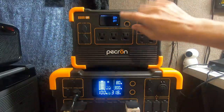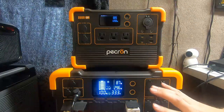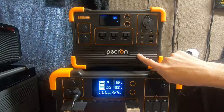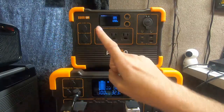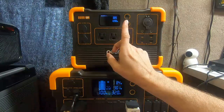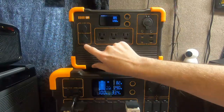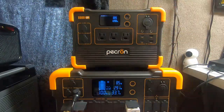Menu number five is 1200 watts. What do you think that is? The 1200 watts is the cutoff or ceiling for the power output meter — that little speedometer gauge. Once you set it to 1200, the meter goes to 100% at 1200 watts output. So if you set it to 600 and used 600 watts, it would read 100%. It's more of a display calibration. This is a 1200-watt AC inverter, and that's your 1200-watt limit shown on the meter. You can change it in increments of 100.